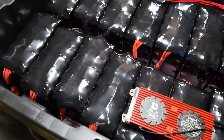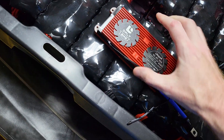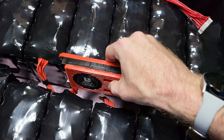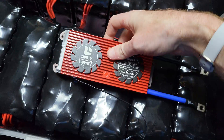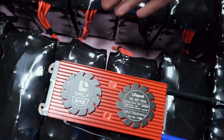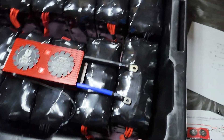In this situation they fit perfectly and the lid will close. The problem with the BMSs is that they don't work with the BMS on top, so what I'll have to do is feed the BMS into the open void in the middle. I need to make sure all connections are well protected and insulated, and I'll probably add some foam to keep everything separated.